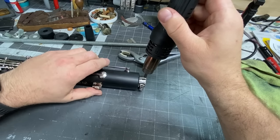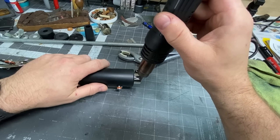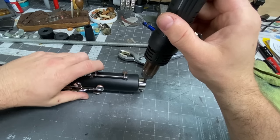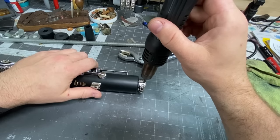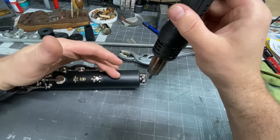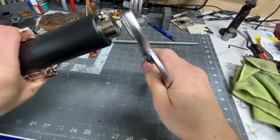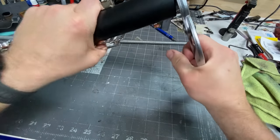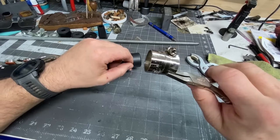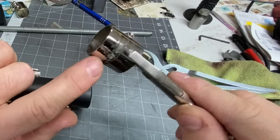There are a number of sources where temperature-controlled heat guns can be gotten from. I've got three or four different varieties and you really have to experiment with what the temperature settings are going to do — so you know where it melts shellac, where it melts plastic, and if you're using it to seat pads, what the temperature is for that. There we go — no damage to the body, and it just heats up this epoxy and makes it let go.